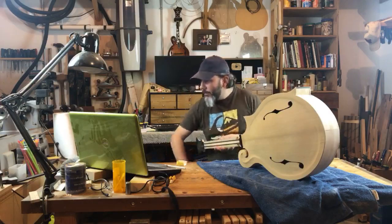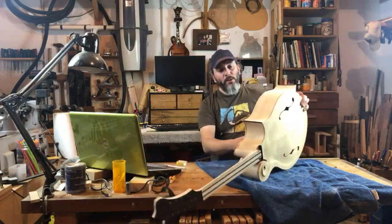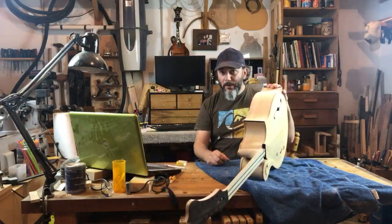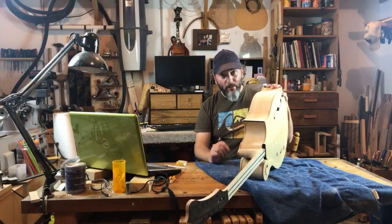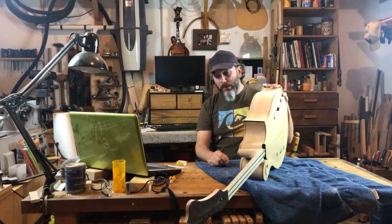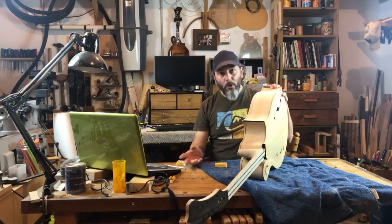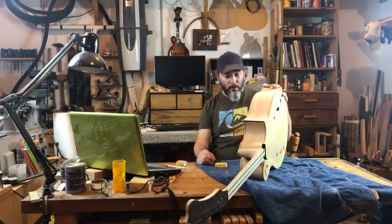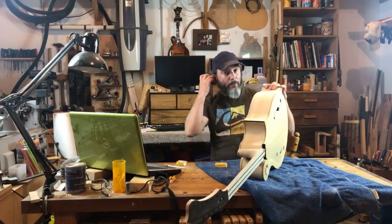What kind of sanding sealer do I use? I usually go straight with color, so I'm going to sand most likely all the way to 400, if I apply leather dyes. Then I seal with a diluted coat of leather dyes, like the lighter colors, and then I can see if I have scratches or whatever, and then I can clean that up. Once that's done, I just continue on with all the colors, and then I would go either with the French polish or with the lacquer. But I don't really use a sealer per se after I'm done with the 400.